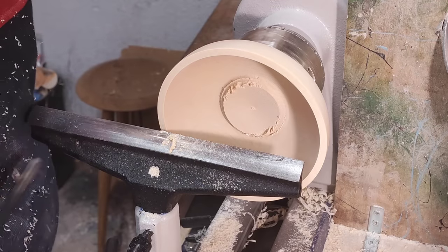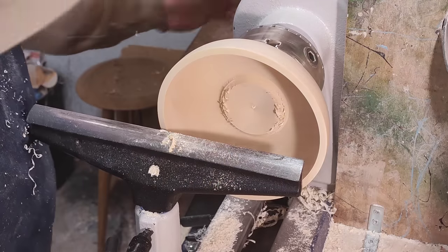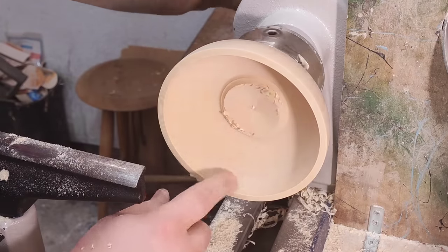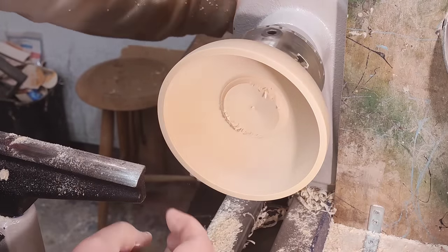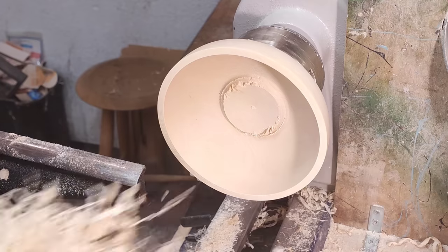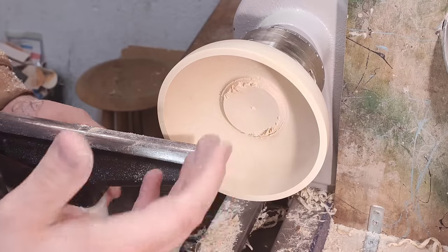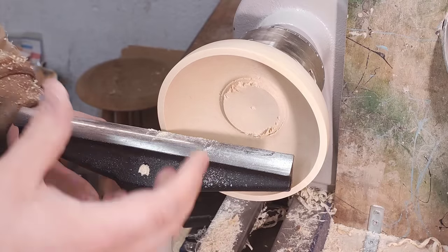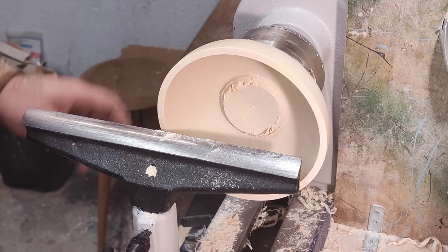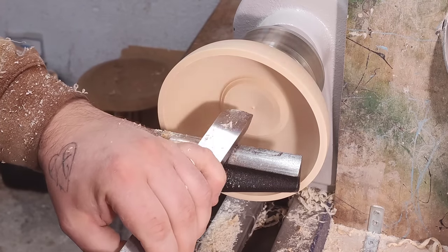Just see where I am in terms of depth — yeah, that's plenty. Now all I have to do is scrape this knob. The rim is cut cleanly, which is important with this particular batch of maple because it likes to give a sort of crushed grain — not sure why since it's hard maple. So I have a bowl scraper here with a shallow curve.